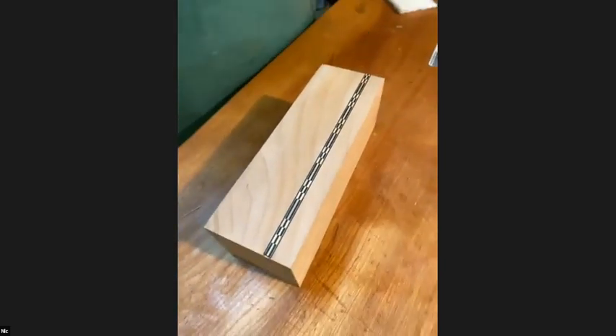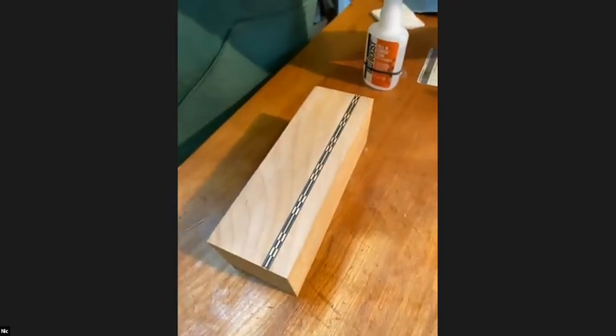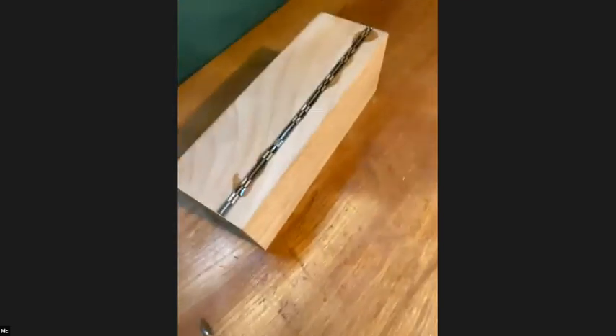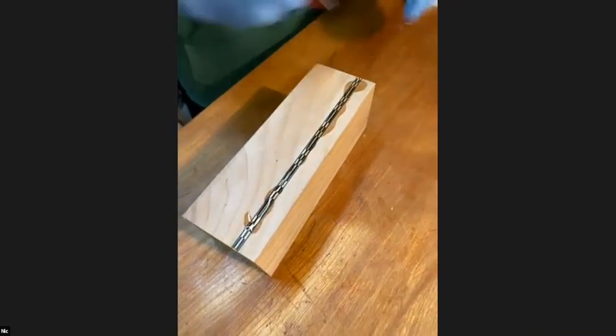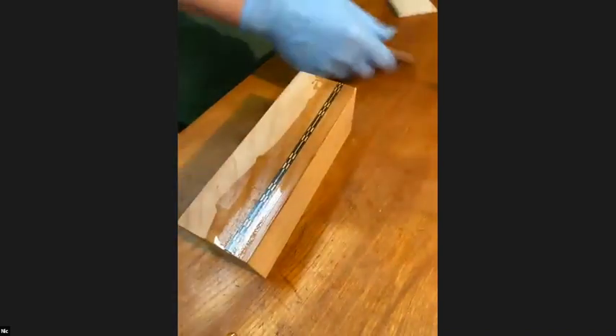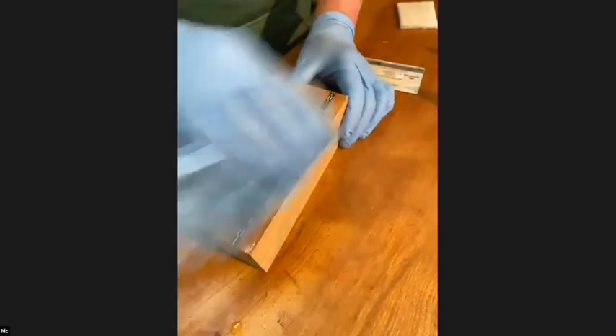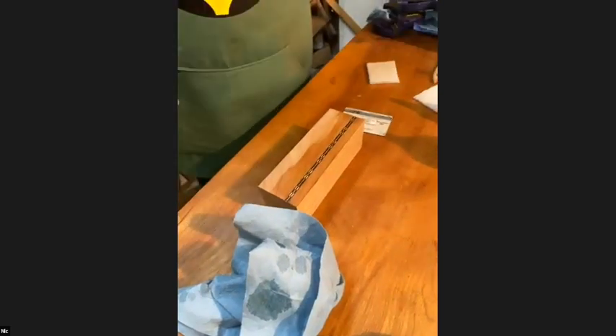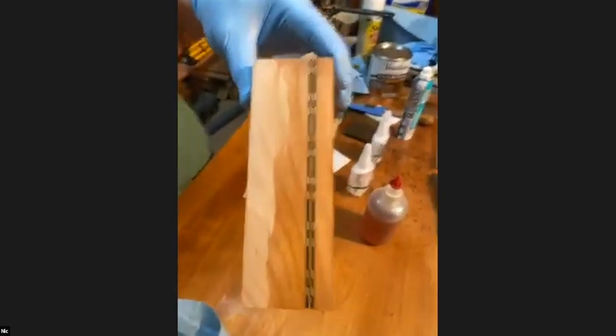For commercial inlay strips that sometimes have little gaps, I use the thin formula. I pot it on, wipe off the excess, kick it over, and now when I go to do whatever finish over the top it's not going to pucker in at the little spaces between the inlay.